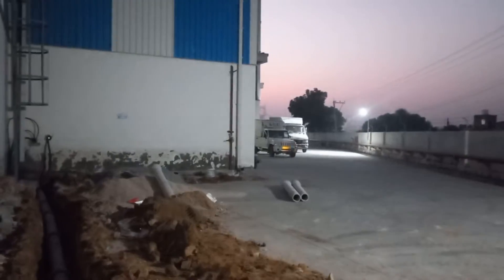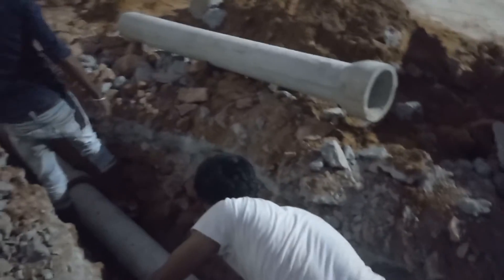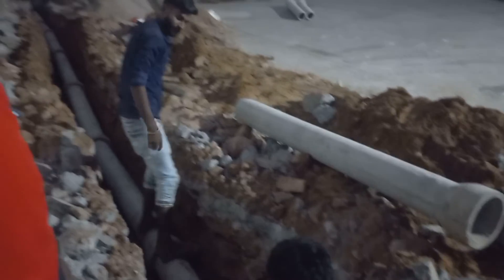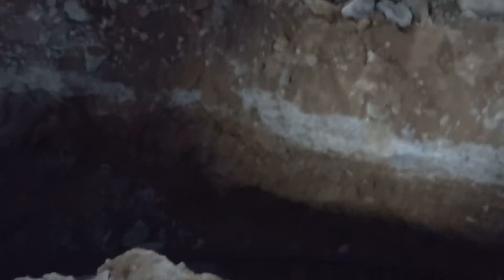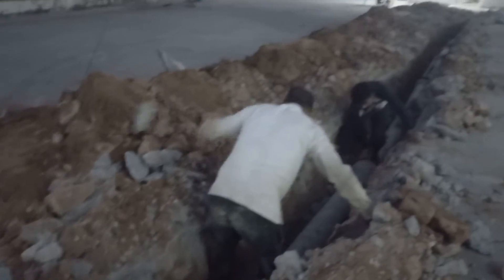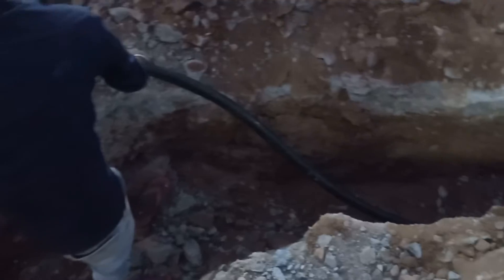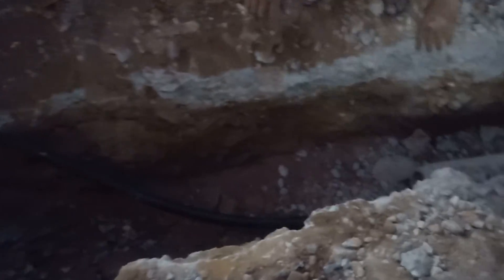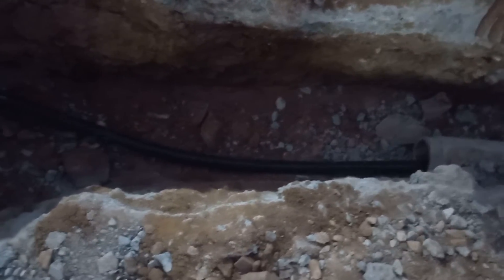The length of this Hume pipe is 2.5 metres, and the diameter is 10 inches at the back side and 12 inches at the front. You may think we could have taken this cable without a trench, which is also a normal process, but this is the main corridor area. So the Hume pipe provides more mechanical strength and also makes it easier for maintenance purposes in the future.